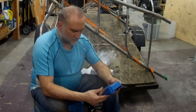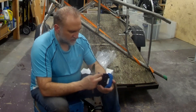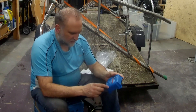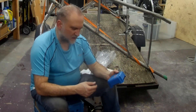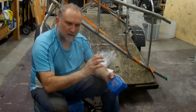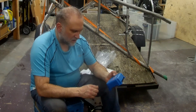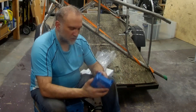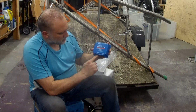Everything is 12 volts, so this little box is all that really comes with it. It's got nifty little screw-down connectors, which I like a lot. It has a little blue-green LED for on/off and a heat sink on the back, which is good. This one feels heavier than the Celia unit — the transformer is probably a bit bigger. It's isolated, so it's not tied into the same grounding as the rest of the electronics. It's also IP53, meaning it has weather protection built in, and it has remote capability, which I didn't know about.